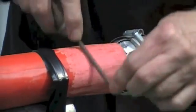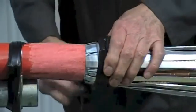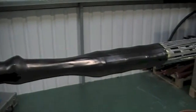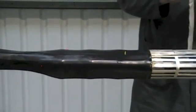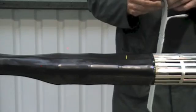Before fitting the outer tube, rough up the cable jacket to provide a good adhesive key for the outer shrink tube. Tape over any sharp points. After fitting the first outer shrink tube, before fitting the remaining outer shrink tube, apply a turn of grey mastic tape 75mm in from one end.